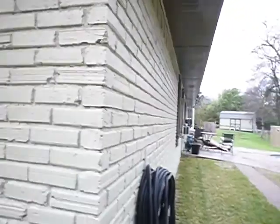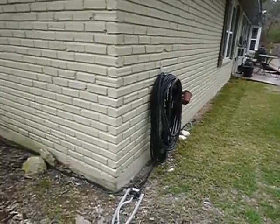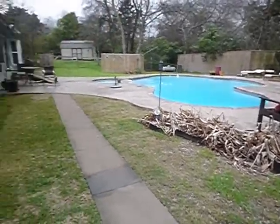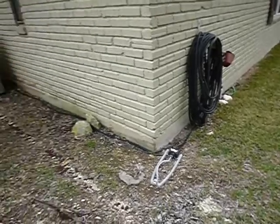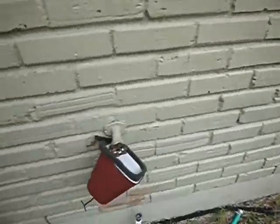We've got some deflection here and we're going to take some measurements. Right in here we have level grading but poor drainage. Most of the house has a decent swale with water going away from the structure, and I'll show you the front as well. But right in this area we're not getting the drainage we'd like to have.